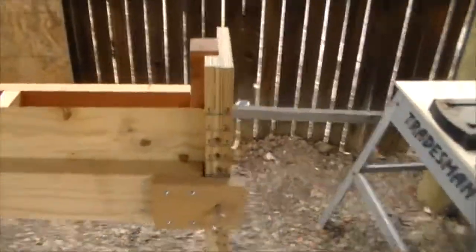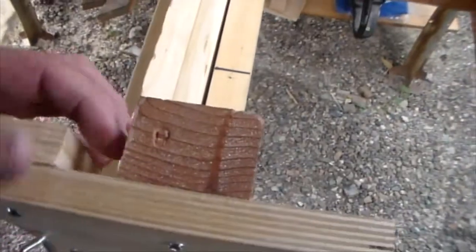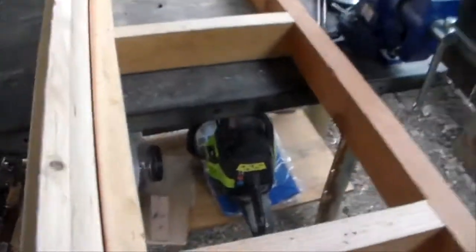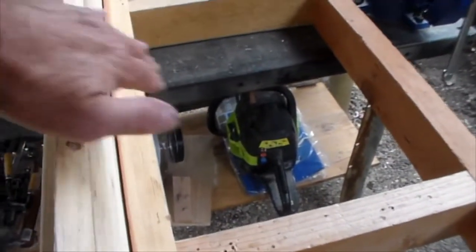Secondly, on the sawmill here, there's the groove where this saw guide slides up and down for the height adjustments, as you can see there. Obviously, it's a little wider than this board for variations from temperature and so on, so it'll slide easy. But you end up with this little gap here. And I've noticed while cutting, especially the more I get toward the center down here, this thing just flexes in and out.